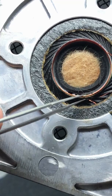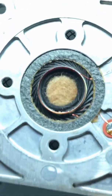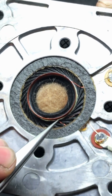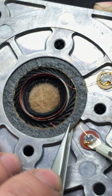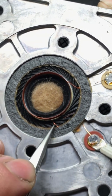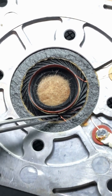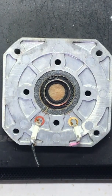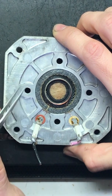Make sure you do not touch the coil with epoxy, else you'll face a problem because the coil would be too thick to fit back into the magnet gap. I strongly suggest that you do not put any epoxy on that section. You can gently pry open and try to remove part of the adhesive tape, do the solder joint, pass the wire under the adhesive tape, and let that part remain free-running as it is in reality. In some cases you cannot remove this adhesive layer tape at all.